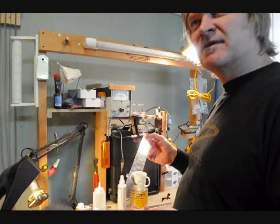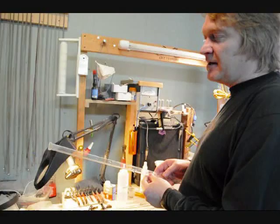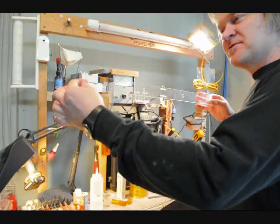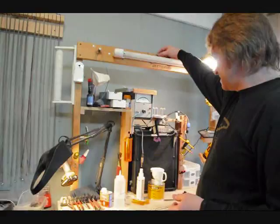But I only do the final inspection now, as I was handing off the initial setup duties to other people. I had to come up with a consistent measure. So I just CNC machined this, with 3 points. You set it down on the neck, and if the neck is too straight, it'll rock, and you can tell. If it's got too much relief in it, you'll see a gap under this pin here. So it's a real nice, simple, consistent system.